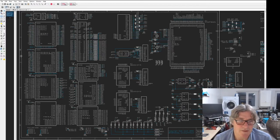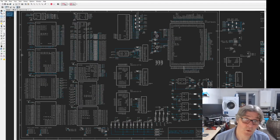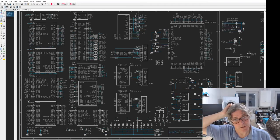And power signals. So that's 64 digital signals from the ECP5 plus 8, that's 72. I2C, 74. UART, 76. And then we've got 4 pins which can be used for power. So we want the B bus 3.3 volt, ground, and maybe, I don't know if we want to expose the 2.5 volt or the 1.8 volt. 2.5 volt is not very useful. I don't even know if 1.8 volt is actually any use, but maybe we could have a VBAT as a fourth signal. Might be useful. I don't know how important battery powering this would be.